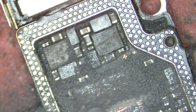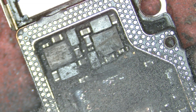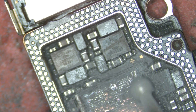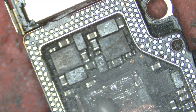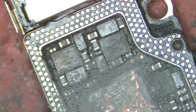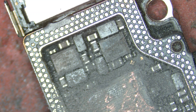Then shift to the smaller spherical tip. You've got to watch out for the side components. If you damage a resistor or capacitor, no worries — just leave it to the end. You can remove it and replace it once you drill out the Wi-Fi module.